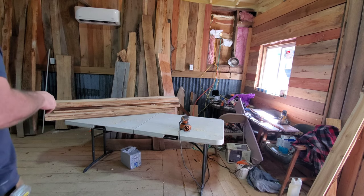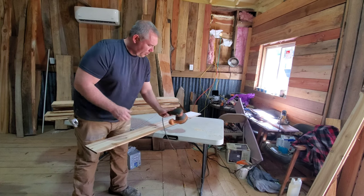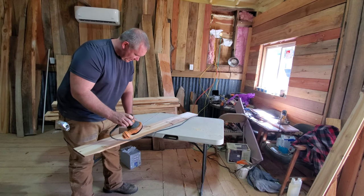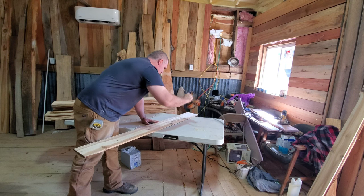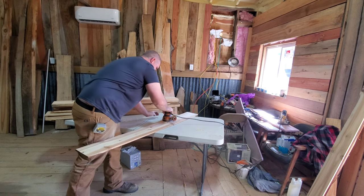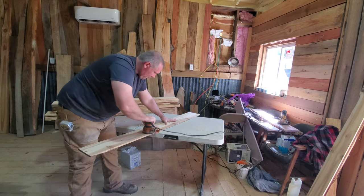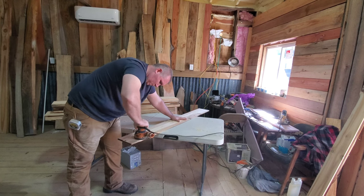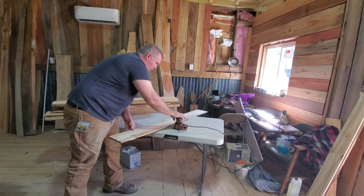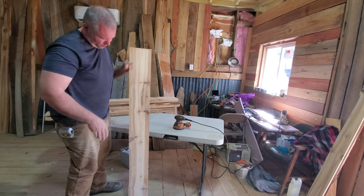Okay folks, so it's been a couple weeks since the planing. Now I'm going to take my orbital sander and lightly sand any raised edges, since these boards have been drying here in my shop. I'll just lightly sand each one of these to take those raised edges off.